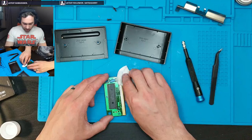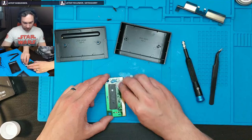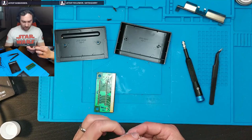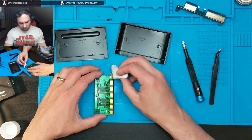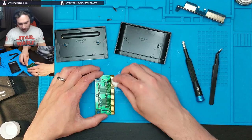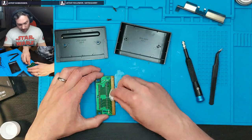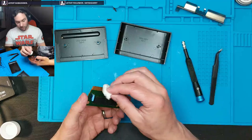You have to be very careful with these contacts. I know Nintendo were in the habit of using gold plating on them, so you have to be careful because they are very, very thin plating and gold is very soft. They were obsessed with it at one point — I don't think they still do it with Switch cartridges. I am sure they were doing it up to the Game Boy Advance era. I think it was copper, then something on top, then gold. I don't know if Sega did the same, but it looks like gold to me — it doesn't look like copper. So you have to be very careful — alcohol and a cotton swab should hopefully clean off any markings and ensure a good clean connection.